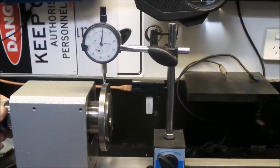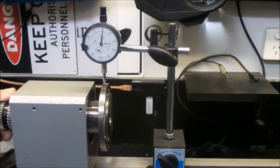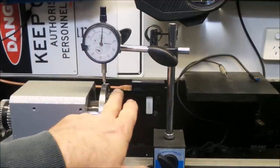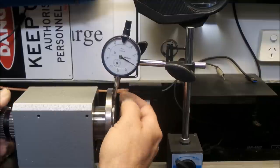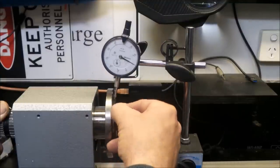With this indicator on, we're getting one hundredth of a millimeter, and it's in the same spots. I've still got the highs and lows marked from when it was here originally and the high is still in the same spot and the low is still in the same spot, which I assume means that's probably in the machining on the shaft. I'm not sure if that's an improvement on what we had before, but I think it might be a little bit. I'm struggling to get a good read with this indicator on the register — it's not well suited to this spot. It's very rough, this register for the chuck — I can feel lumps in it with my nail. I think once I get the lathe running I'll be able to clean that up a bit. It's very tight as well, so it could do with just a fraction taken off it.